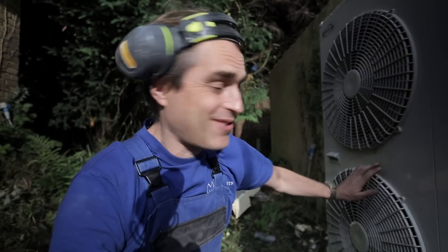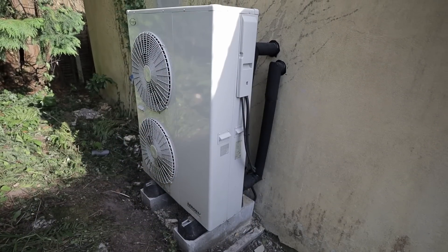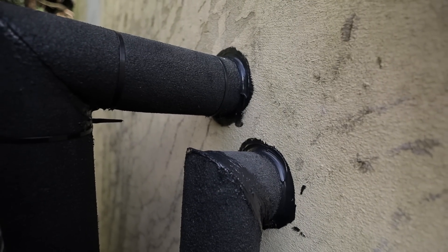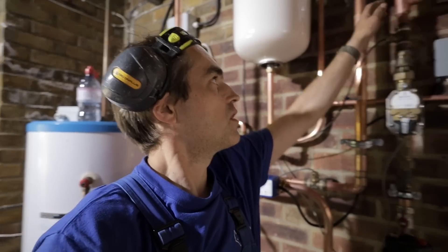Success — the unit's running on hot water finally, and that's maximum output. This three-year-old unit was probably cycling like crazy, so it hasn't had the best life. Marie and Simon managed to finish all the external insulation — this is primary pro for 35 millimeter copper. The flow pipework is really hot to the touch, already around 55 degrees on the flow.